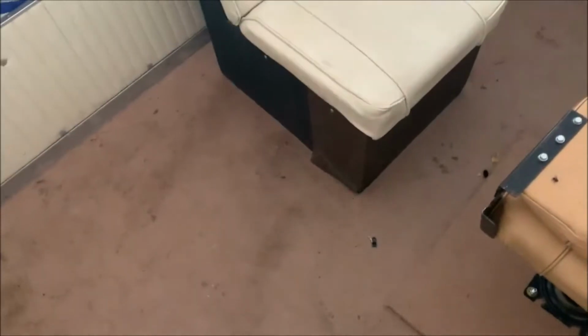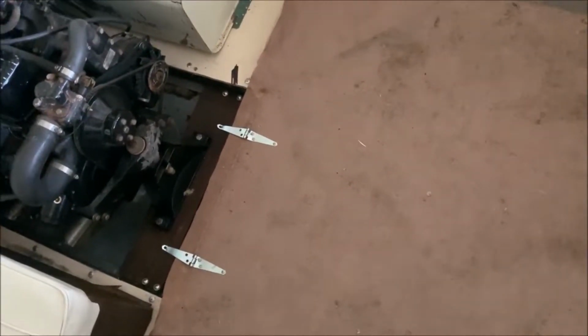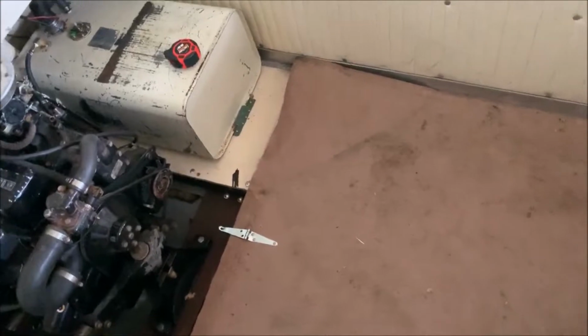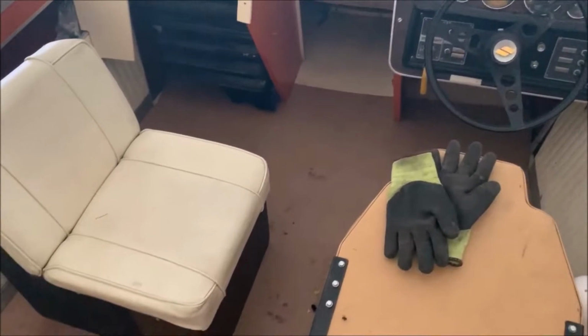But I want something that's going to block a little more heat from the bottom getting to my plastic. The only disadvantage to this Starboard plastic that I've got in the bottom of the boat is it will expand and contract with temperatures. And when it gets really hot, like the sun's shining down on it, it really starts to expand and deform. So what I want to do is create an insulating layer to prevent it from doing that. I love the plastic in the boat because at no time do I ever have to worry about it soaking up water and rotting away on me. It's going to last longer than most likely myself or the boat will last. So let's play around with some of this stuff.